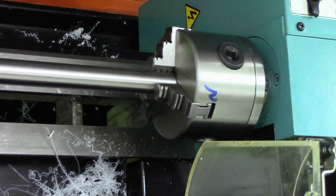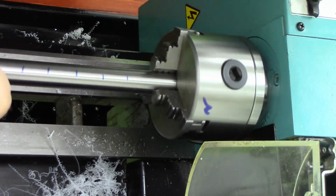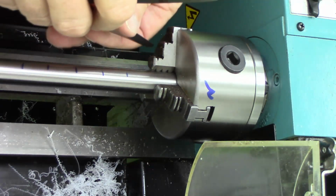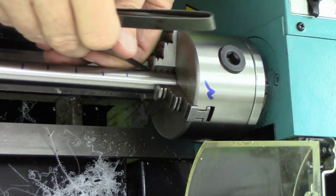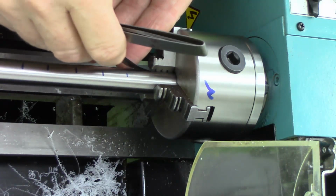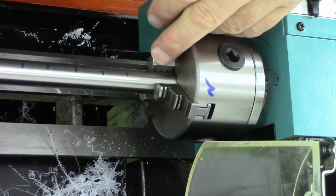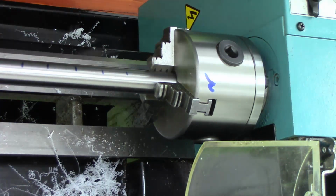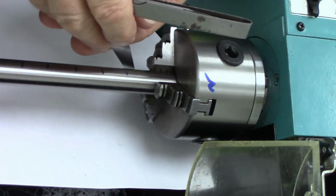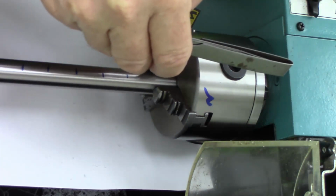So I chucked up various workpieces just to see whether the chucks were still working properly, and I discovered something quite alarming, which I haven't noticed before, which is that, and I don't know if you can see this, that is a 3 thou shim that I can get in up to. See, there are teeth on here. Maybe I'll put something underneath it that makes it a bit better. I can get a 3 thou shim past that one,